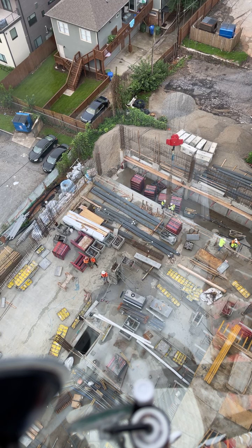Now when I'm doing this, I'm also watching the weight on my LMI to let me know if it's losing weight. If it's losing weight, then that means they're jammed up down there. So I know that when I pulled this column, it weighed 254 pounds. So when I start losing weight, I know they're jammed up before they even know it. So we're at 112. So they're going to fight with it a little bit. And as they get it, and as it starts going, then the weight will come back up.